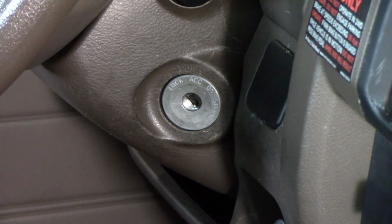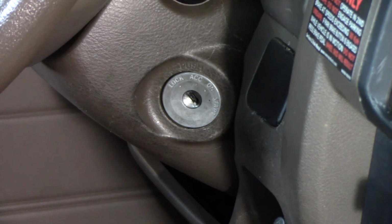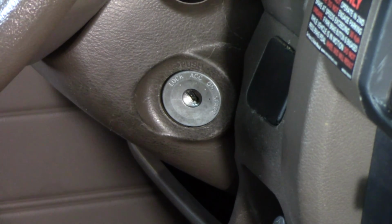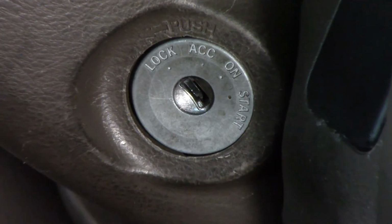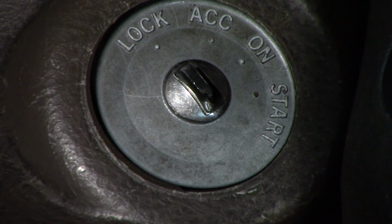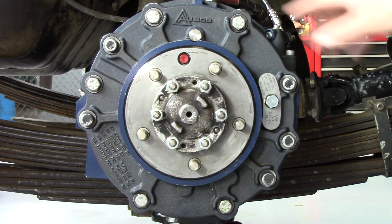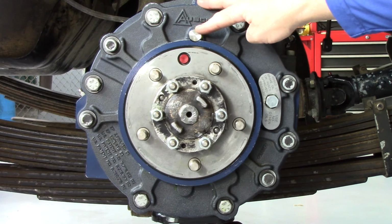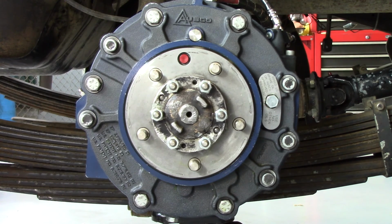Prior to starting the service and checks, please ensure the LC brakes are applied with no power being supplied to the premium pump pack. Remove the key from the ignition and we're ready to start work on the brakes. Now let's start by measuring the wear pin height and recording both wear pin measurements on our checklist. Please don't forget that whatever you're doing to this brake, you need to do to the brake on the other side of the vehicle.